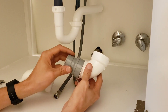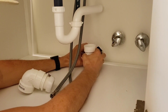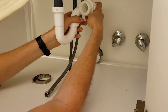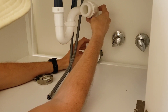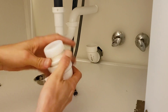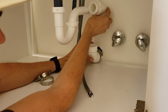The adapter came included in the other kit, but you can buy it separately. If you have a copper pipe, you can use a rubber coupling over it. I'm going to fit this rubber coupling over the drain pipe, put the PVC pipe over it, cut this extension tube shorter to get it as close as I need, and then cut a piece of one-and-a-half inch PVC pipe to go between the two and glue that with PVC glue. There's also a 90-degree fitting — a one-and-a-half inch male adapter that fits into the 90-degree elbow — with a male connector already integrated into it.